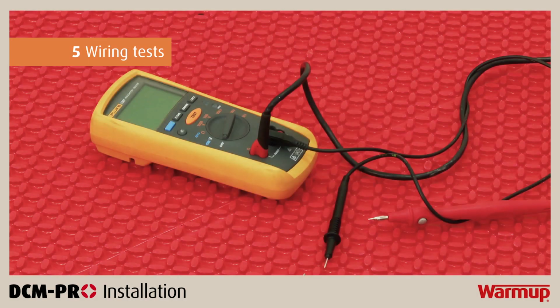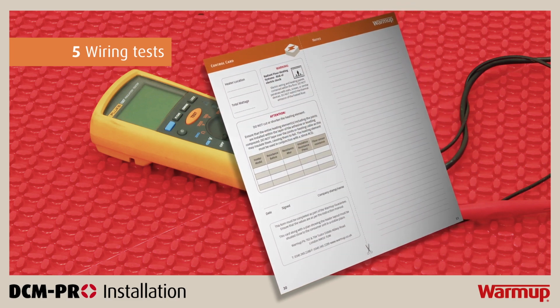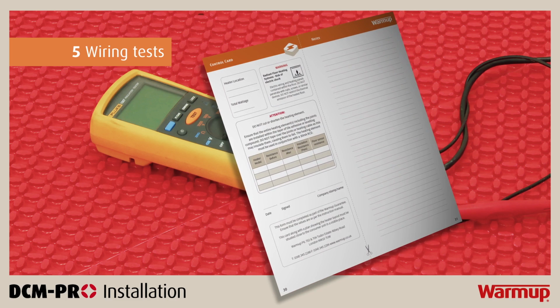It is essential that you perform a resistance test and an insulation resistance test on the heater before, during and after the installation to ensure no damage has occurred at any stage of the installation. The installer must compare the results of the tests to the values provided in your installation manual and log the results in the control card. This control card must then be kept for warranty purposes.